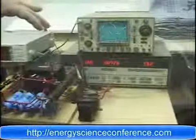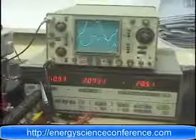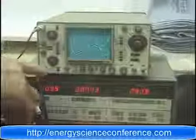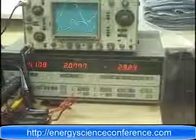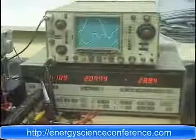Now, we have one other little thing to show you, and it's pretty startling. If you continue to change the waveforms appropriately on this, due to the way that these capacitors are made to operate with these switches, we can actually send back more current than we take from the line. And that results in these wattages going negative. Oh my God. So that means we are still dissipating 102 watts in the resistor, but we're sending back 30 watts to the power company.